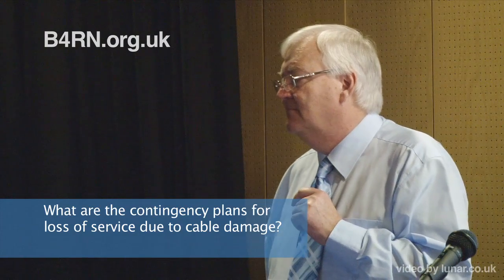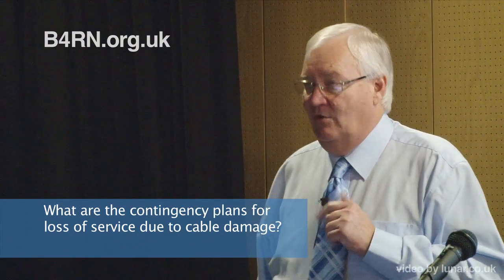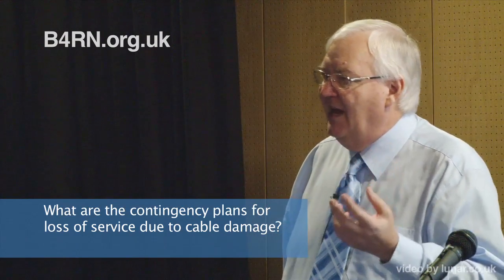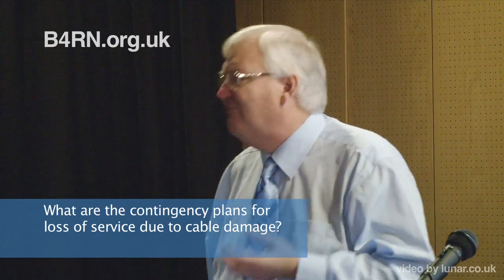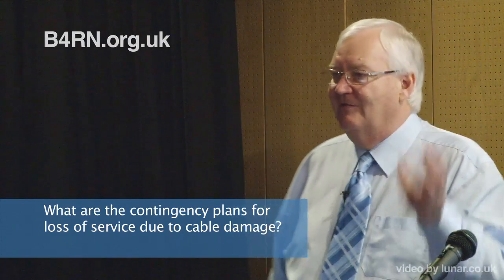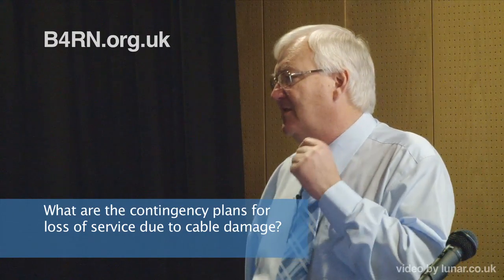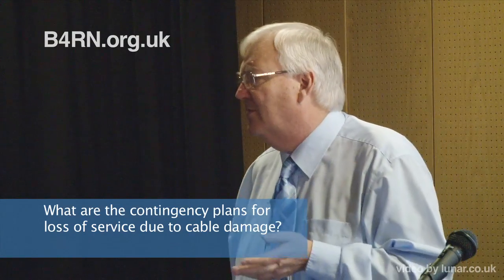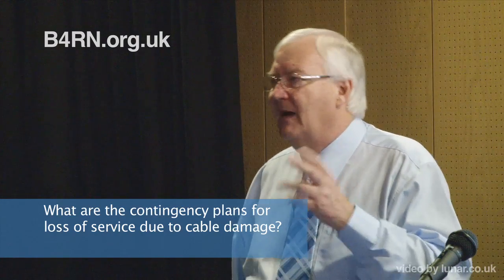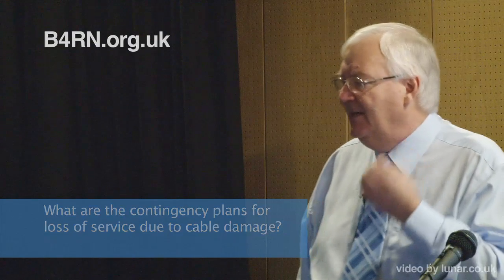So it sounds as though you're no worse and if anything better off than BT? I think we're a lot better off in a way because BT is dealing with dodgy copper. It doesn't just so much break; it's erratic in its behaviour. I mean, all of you will have had experience of this. The line is up and down, and you report it, and they think they fixed it, and they don't. Fibre works or it doesn't work, so it's very clear cut. In general, the maintenance of a fibre network is about 1/10 of what it is for a copper network. So the overall support needed is a lot less.